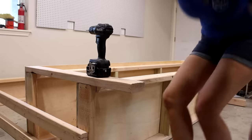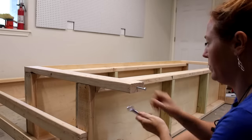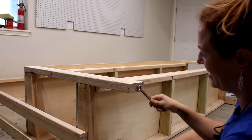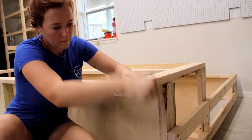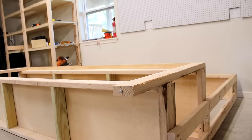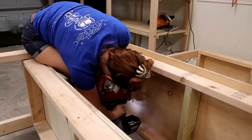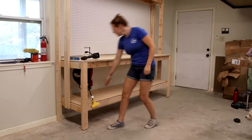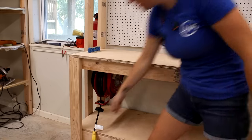Now it's just finishing touches. I laid the bench back over to do two more add-ons. First, I added some adjustable feet. A great trick is to simply use a lag screw — I pre-drilled into both front legs then threaded in a lag screw. When the workbench is stood up, I used a wrench to raise or lower the front end to level it regardless of where I move it in the garage. Second, I added a cord reel. I have eight outlets on my wall, but if I want to work in the center of my garage, a retractable cord reel lets me plug into the wall outlet and pull power anywhere I need it. These reels by Reel Craft have a superior quality three-tap that are designed for long life and are made in the US.